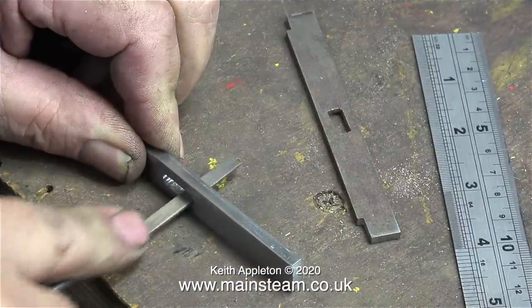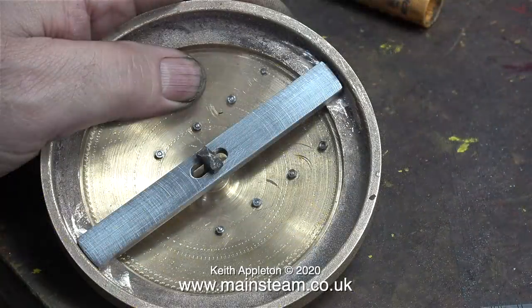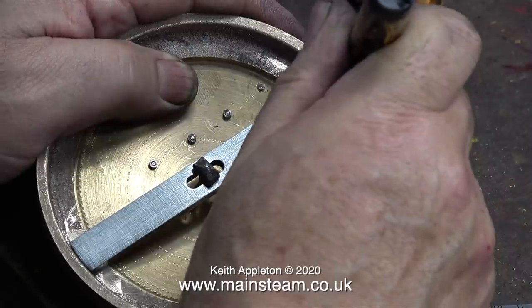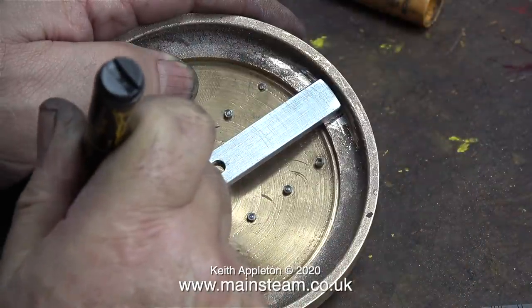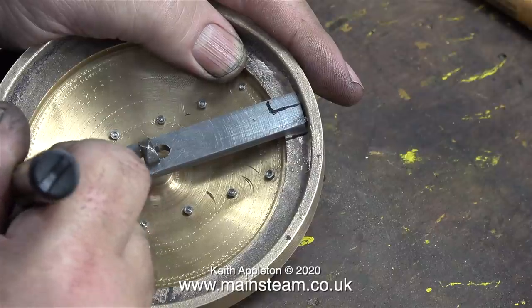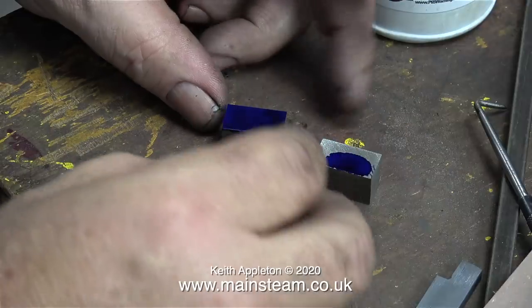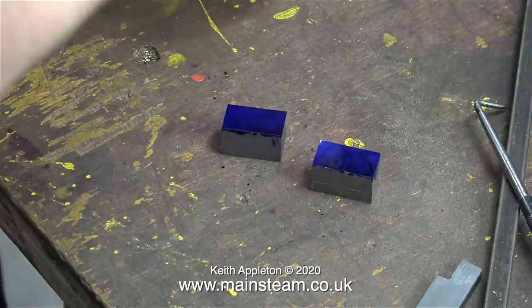This clip shows me using a small needle file just to clean up the tool marks on the inside of the slot. Here you see the general arrangement — the smokebox dart is in the right place, and I'm using this to hold the crossbar in place relative to the smokebox ring. I'm marking the position of the crossbar on the smokebox ring, and also marking the bar itself at each end. The next part of the job is to make the two supports that will hold the crossbar in the right position.